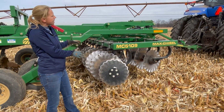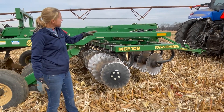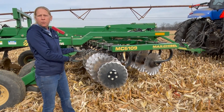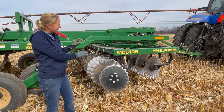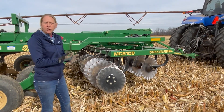We've got some very aggressive blades on the front that are really helping to size the residue. The depth I run these is controlled hydraulically — I can do that from the cab. I don't really want to run these any deeper than I have to. I run them deep enough to size residue and make it flow. So this is one of the first adjustments I make: setting this depth where I want it to make sure I can cut enough residue.